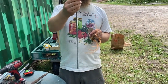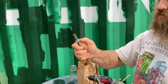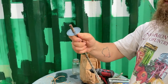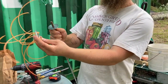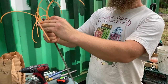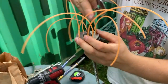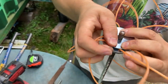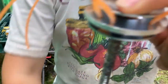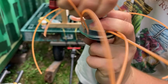The next step is to take your threaded rod and your regular three-eighths nut and put it on about two inches. Then take one of your three-eighths two-inch washers and put it on there, and then your heavy washer with all the strings threaded through goes on like this. The only part that's at all tricky is you need to get your next washer on there so that it's pushing all those strings out to the side. Then you're going to put your lock nut on the end.